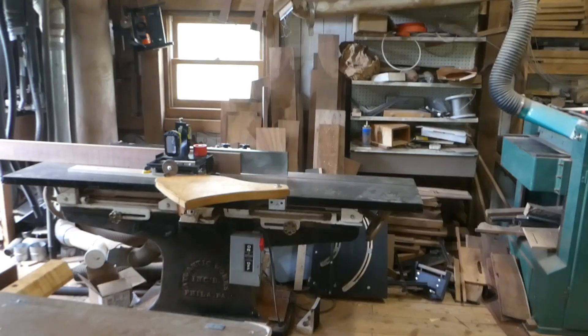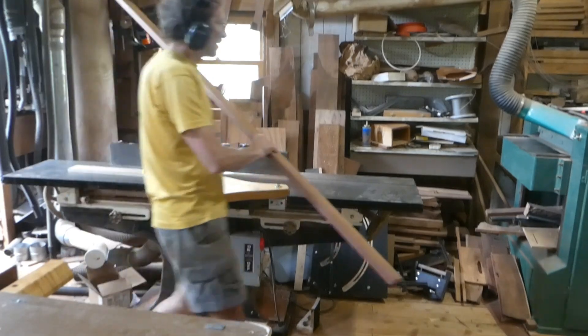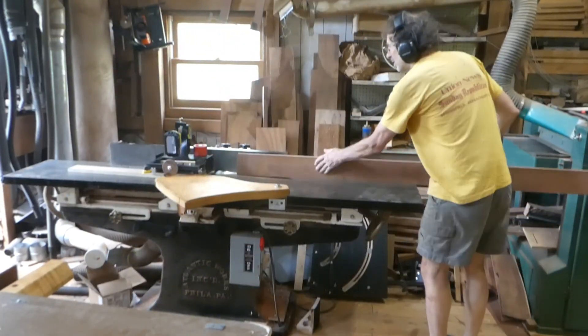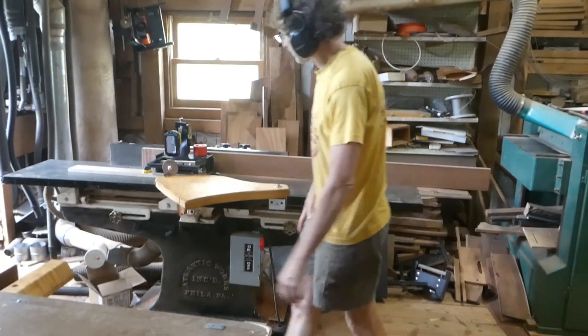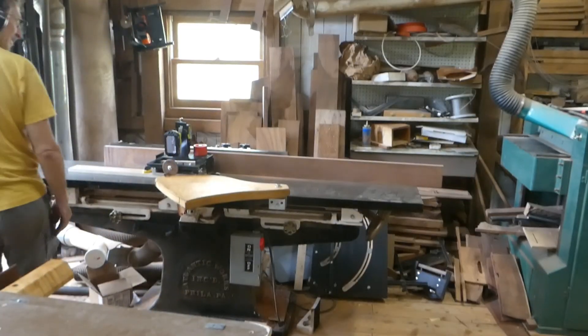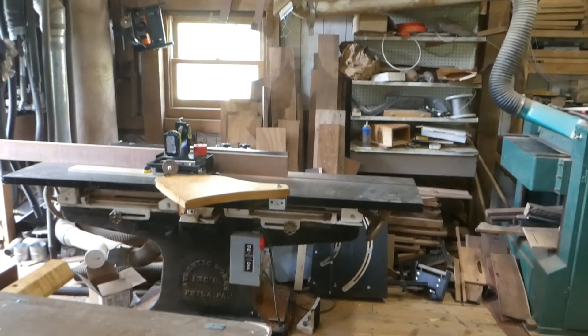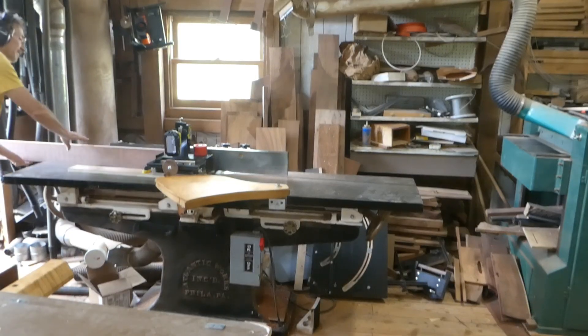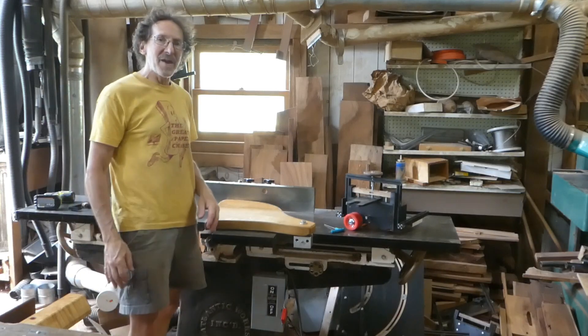The configuration of the little Proteus with the two feed rollers on the same shaft, right at the beginning of the outfeed table, works really well for face jointing. With a wide board, you'll have rollers bearing at 6 inches of width at the very beginning of the cut. The front end of the base plate is slightly higher — it's shimmed up on the subplate so that the feeder is tending to force the board down into the outfeed table.